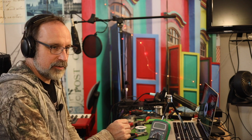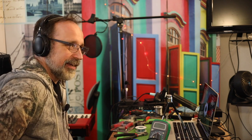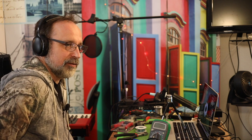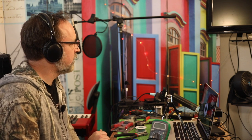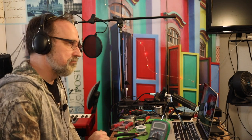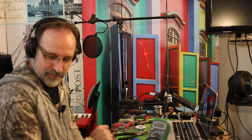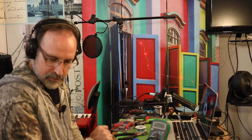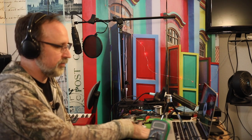All right, so I'm back. I want to see if I can take care of this. For lack of better terms, and this may not actually be the problem, I'm going to call it a ground loop issue. I think you have to have at least two units that are connected. That camera is not even connected to ground, really. And then there wasn't really any issue until I got close to this computer.